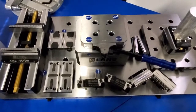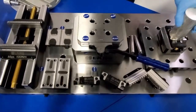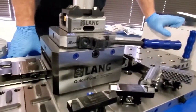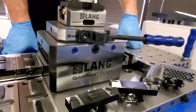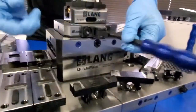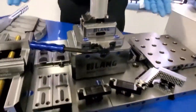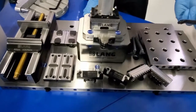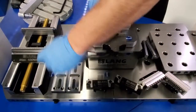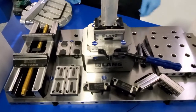How simple can the modularity of the Lang system get? We talked about actuation earlier, and now we're going to drop a vise on it. Previously we torqued it to make sure it's nice and tight, but this is our quick lock. What the quick lock does is bring it to the appropriate spec with just the twist of a handle — watch as we pull this handle over and it sucks it right down. This is very popular in automation and in our facility — very quick, easy to use. You can pull it right out and slide it right back in. This is when we start talking about reliability, process, repetition, and interchangeability. You can repeat on and off the Lang system all day long at less than or equal to five microns.